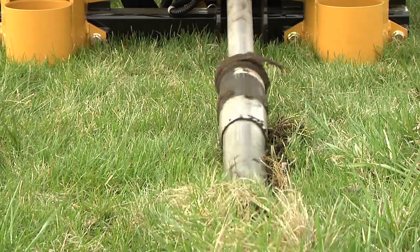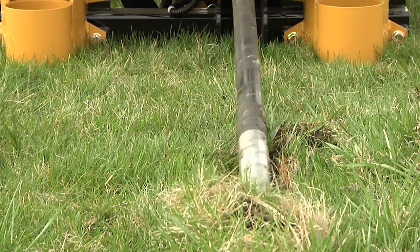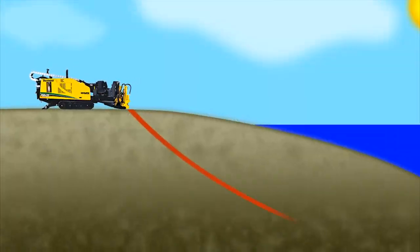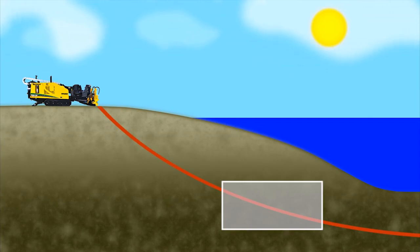No Fire Stick drill rod has a higher pitch change than 10% over a 10-foot length. For example, making an adjustment from minus 25 to minus 10 means you have oversteered the rod. Not only that, but every rod that follows will pass through that excessive point of correction. This will fatigue the rods, bow them, and even possibly lead to down-hole rod failure.